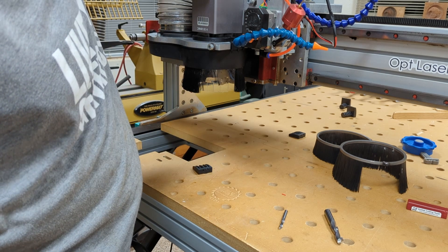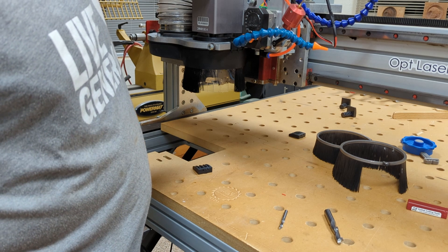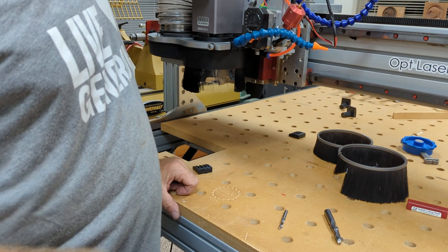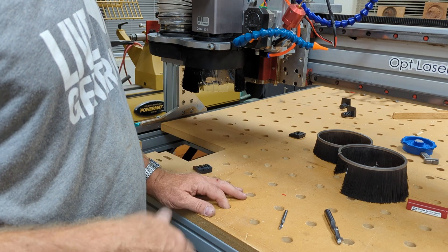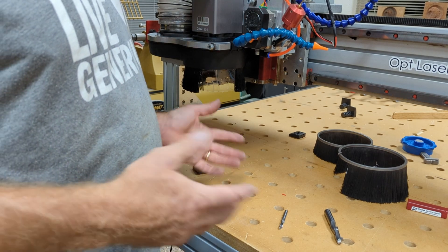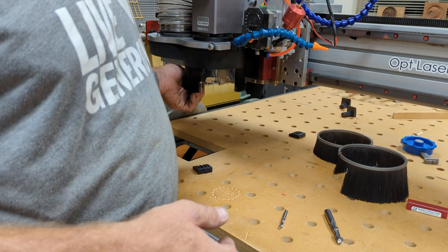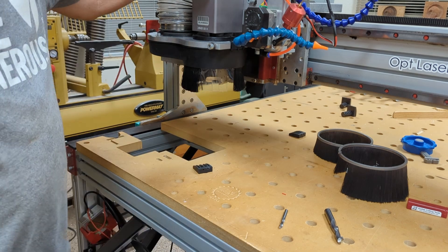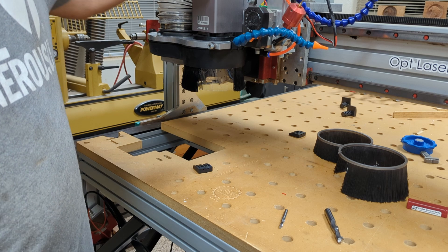For large bits I need to seal it all the way around, but you can still make a window in it so you can see what's going on — is it cutting well, is it burning, what does the surface look like? When that light is off I just don't like the feeling of not being able to see in there. My work is almost all one-of-a-kind — I don't do repeat projects — so I want to see that first one and make adjustments to my feeds. In production work you debug your setup and feeds and speeds on the first one, then run a million of them without watching. But for me, everything is a one-of-a-kind and I sometimes need to jog manually and watch what's going on.